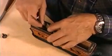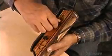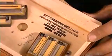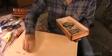After staining and varnishing the keyboard, he hooks a spring between each valve and the button that operates it. He adjusts the spring tension and checks the air seal. Then he stamps the company name inside. Now he screws the finished keyboard to the finished wind chest.